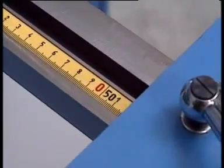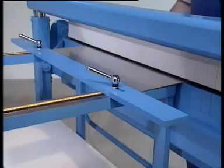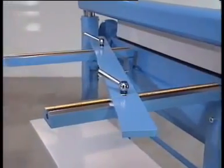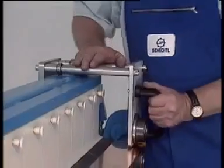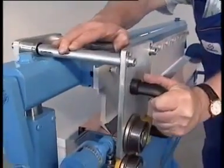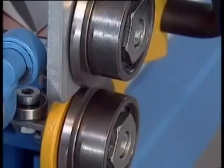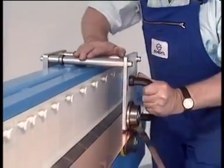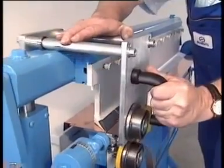The optional back gauge stop is a useful tool for efficiently working serious jobs. The back gauge is infinitely adjustable up to a 19.5 inch working depth and can be adjusted for angled bends of up to 20 degrees. The back gauge stop can be ordered in corresponding lengths for all models. The roller shear is another option offered. It can cut steel sheets either individually or at construction sites of up to 22 gauge and aluminum sheets. The roller shear is simply placed on the clamping beam cheek and guided by a roller bearing. The roller blades can be easily adjusted and reground.